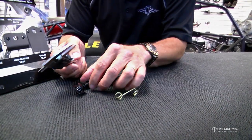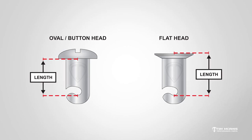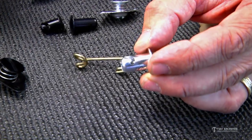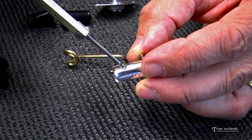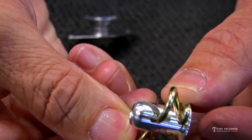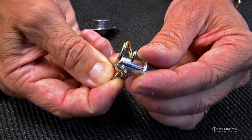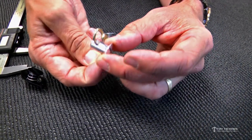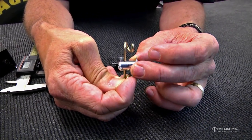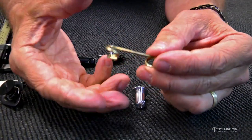So this is a 400 deep spring — that's how it's measured from this surface to this surface. Along with that, you have the same number that goes from the bottom of the head to the outermost point of that clip. The way this works is the spring starts in here, and as you twist it around it's flexing that spring up tight. It goes through this little track and snaps in via this little hook at the bottom, and that's what keeps it from coming undone. With the tension on it, it clicks into place and holds — and when you take it loose, you turn it counterclockwise, it pops up out of there, and a quarter turn and it's out.